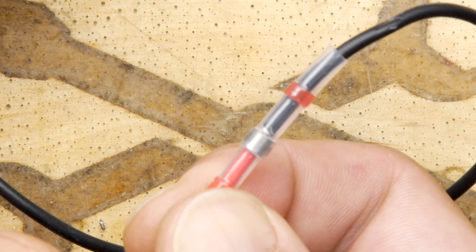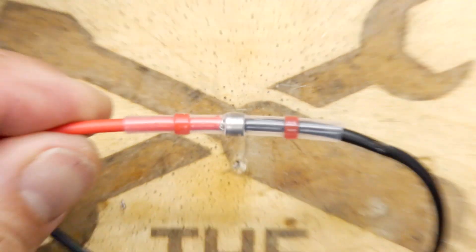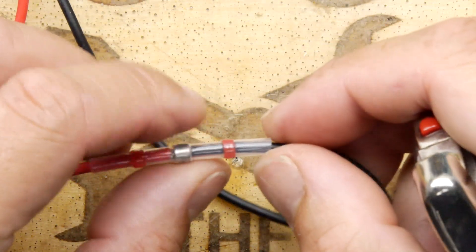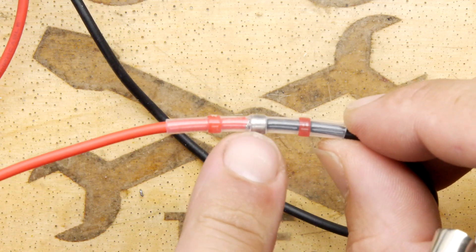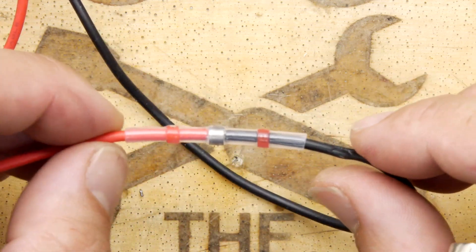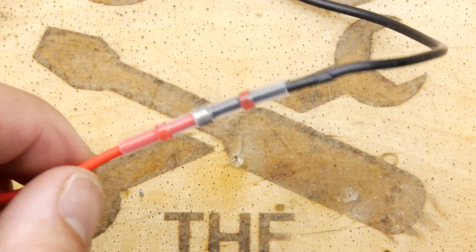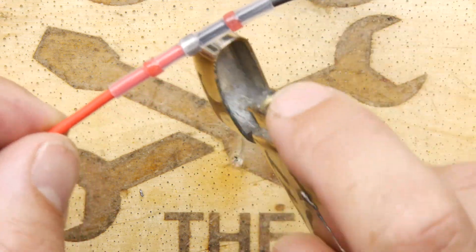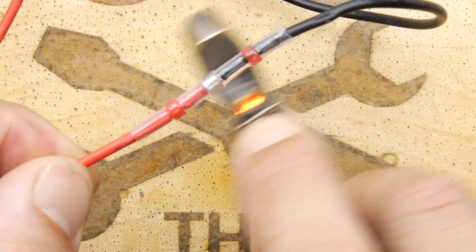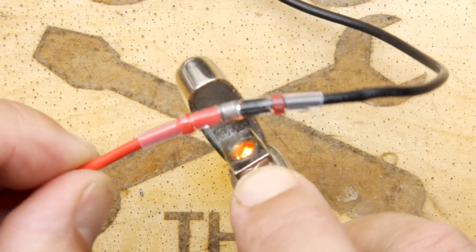It's not a piece of wire — it's the actual splice itself. So it looks pretty good. Now you're going to get your heat source. I'm going to use just a regular lighter here. They have developed these so that the solder melts before everything else catches fire. If you use a really hot heat source like a MAP gas blowtorch, you're going to have problems. You need something relatively low — hot air from a hot air blower might be better. I'm working it back and forth, and you can see it's starting to melt already. I'm just working it around that middle section because I want that solder to flow.